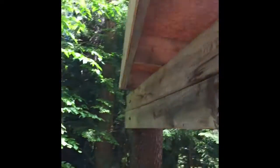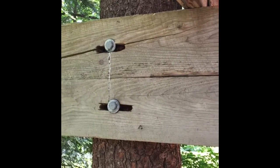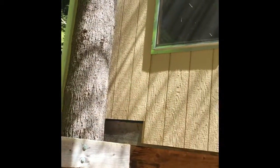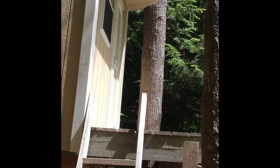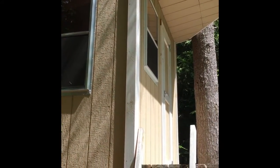I put up a post — there are lots of different ways you can do this. Having these slots so that the bolts can move turned out to be a pretty critical thing. Then I just built a box frame and set it down on top of those joists. It was a trick to make sure they were all level, but it set down pretty easily. It's essentially an 8x8 shed sitting on an 8x12 platform, so it's got a little front porch.